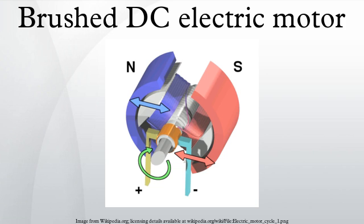These field effects are reversed when the direction of spin is reversed. It is therefore difficult to build an efficient reversible commutated dynamo, since for highest field strength it is necessary to move the brushes to the opposite side of the normal neutral plane. The effect can be considered to be somewhat similar to timing advance in an internal combustion engine. Generally a dynamo that has been designed to run at a certain fixed speed will have its brushes permanently fixed to align the field for highest efficiency at that speed.